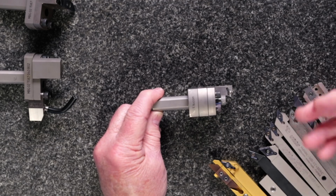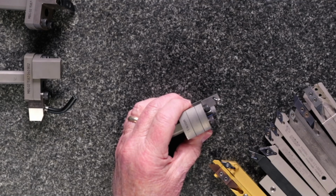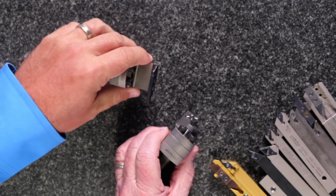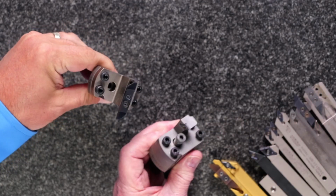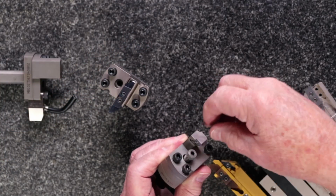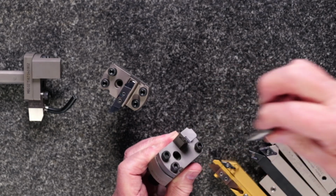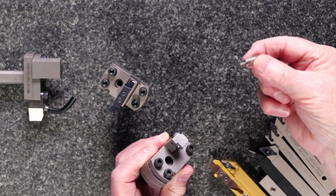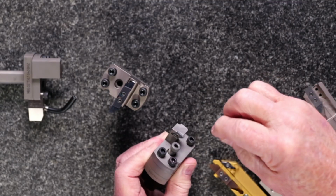Now, on the face where you actually put your working, you can put ISOs, you can put TOPS, you can put Cut 3000 series, you can use bore bars. There's almost nothing you can't do in a turning application that you can't equip one of these special tooling faces on. How that tooling face works is that there are four bolts that will hold it to the spacers and/or the holder system. By loosening that, you'll see in the middle that there is a holder, and there is a lock hole in the back, and there is an eccentric bolt, which essentially is a cam. This fits into that hole and locks down.